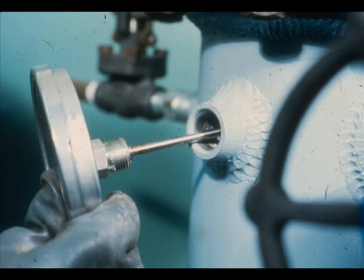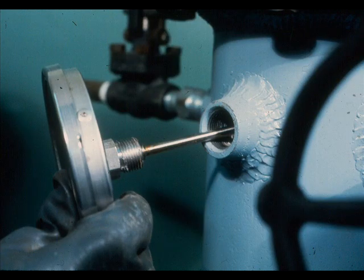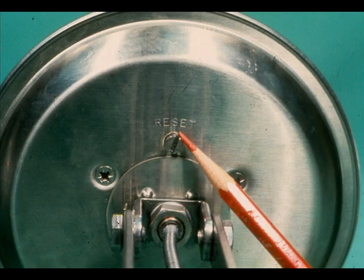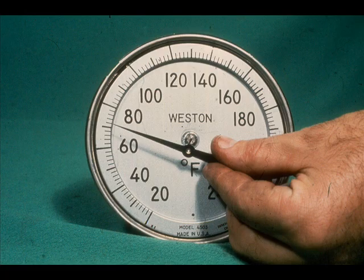One of the most common and dangerous installation mistakes is that the thermometer is erroneously installed without a well. If this thermometer were removed from a pressurized system, the process fluid would be released to the atmosphere. For process use, the thermometer must be in a thermal well. Also, for good response, the well length must be suitable for the stem to be on or near the bottom. Ordinarily, it is not economical to repair the bimetallic thermometer. There is a calibrating adjustment for setting most of them to a known temperature. On some brands, the pointer is pulled and reset to a known temperature. If they do not respond to calibration, replace them with new ones.